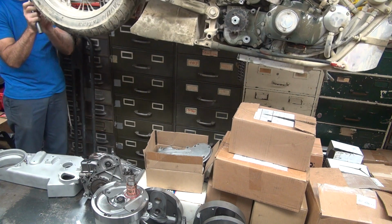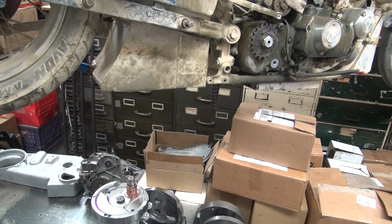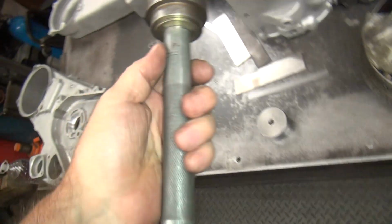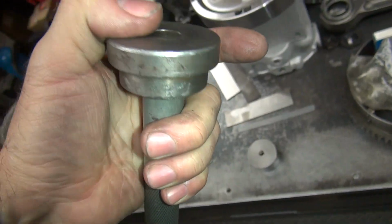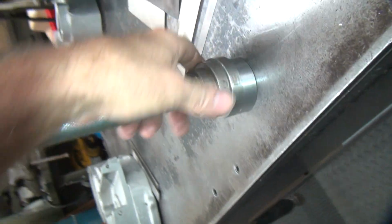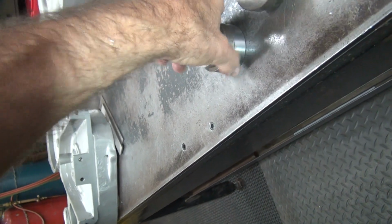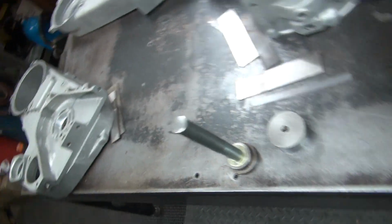Close. Precision washer is too close. Maybe we're hunting on the other side of the bike over here. All right, we'll be back. Okay, I got my washer here. Find one that just fits perfect. Nice and tight on there. Just teeth out below the surface where we want it to be. So now I can beat on this one flat like that. I can pound that one in, lift this out, and push this one directly on that one. Go make sure it's all the way down. So one tool does everything.